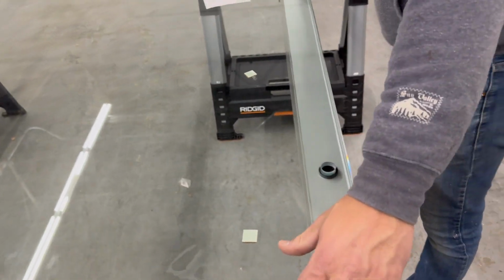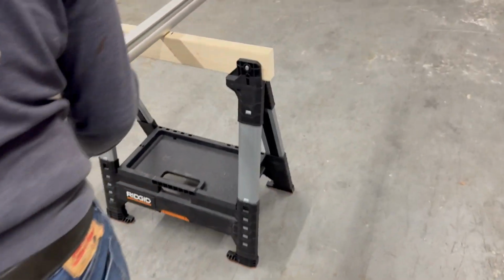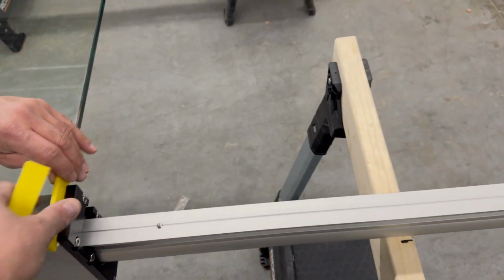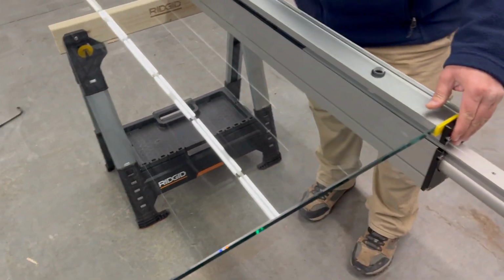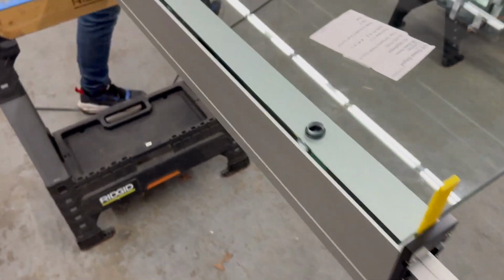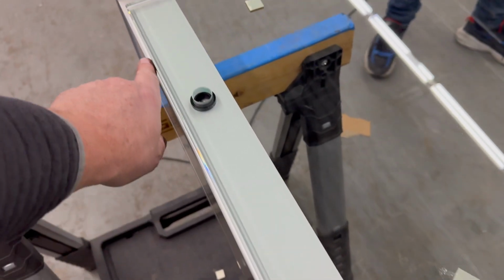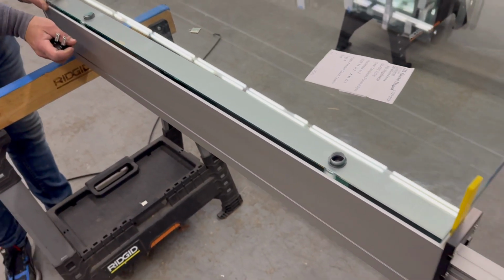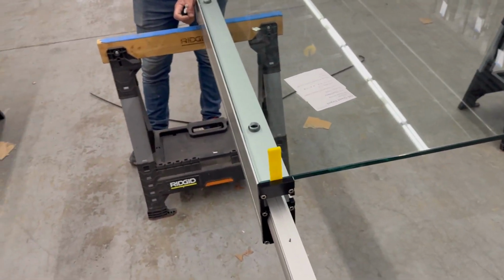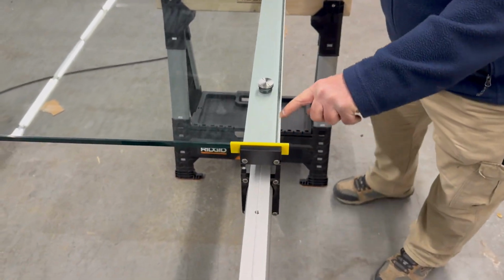And then we have 2 little spacers that we're going to place at the top, 1 on each side, to make sure that the panel of glass is positioned correctly. And it's important to note that there is a slight reveal down the side. The glass is slightly smaller than the distance between the 2 posts. It leaves about a 3/16 reveal. We just want to make sure that that is consistent and even. Just tap it, that looks good. Same on the other side, you can just see the reveal.